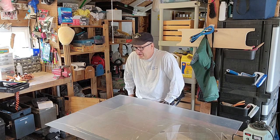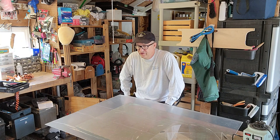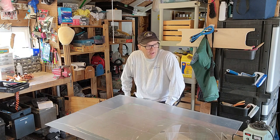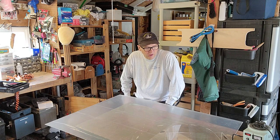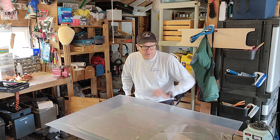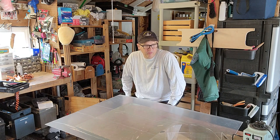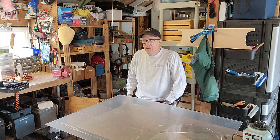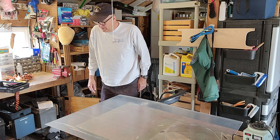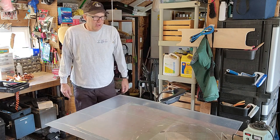I've tried all kinds of different techniques. You can get a glass cutter and etch it, but I find sometimes it cracks and snaps. I find the best way of cutting these things is actually using a jigsaw with a metal cutting blade — I'm able to cut them nice and straight. You can finish off the edges using a torch because it'll polish them off. We also have to cut the hole for the spindle so that it rests on the same spot on the turntable. So let's go down and have a look at the turntable I'm building this for and get some dimensions.